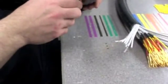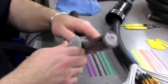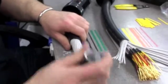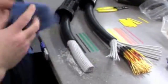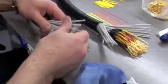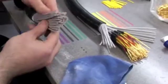Then you want to get your Stanley knife and cut your jacket off like so, to expose all the channels. This cable should have talc inside to make it a bit easier to take the jacket off, but that's what you'll start with.